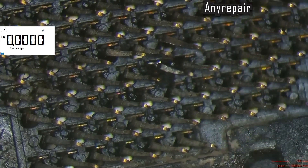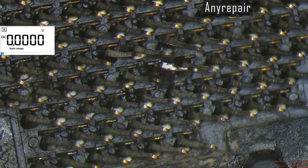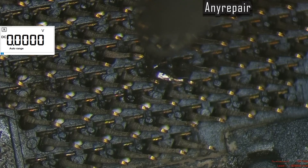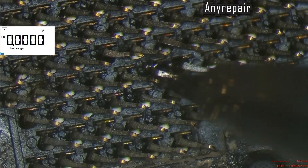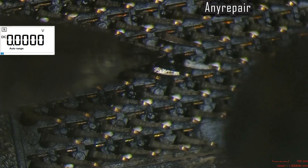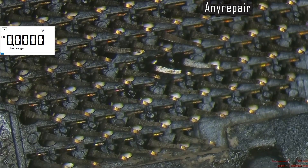We are going in triple speed because it is not an easy one. You do not notice it at all, but it can save you if you don't have a station that can remove the socket, or your board needs a socket removal and re-solder. We are using a hot air gun to solder the pin back, gently pushing with our tweezers to solder the pin in place.